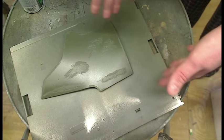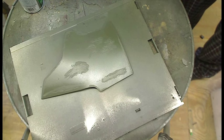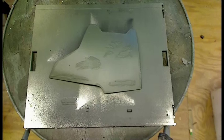Now we'll let this dry, and we'll come back and add our second top coat, which will be our final coat. We're going to put our absolute final layer of paint on this piece, and it is still our forest green, like what's on there now, kind of an olive drab, all right? And I'm going to count along as I do my swipes from left to right and right to left. That way you can get an idea of the rhythm, the tempo that I use for actually spraying. I know it's kind of weird, but it works great.